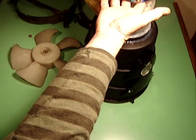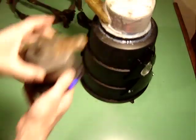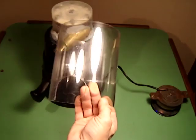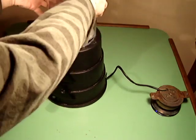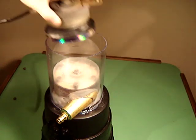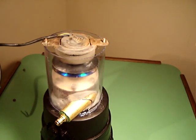Now I have to mount that on top of the CD turbine somehow to keep the magnets separated and make it all work. I've got a piece of six-inch polycarbonate tubing about seven and a quarter inches long that I've got to slot in here — it'll fit over the nozzle for the CD turbine. Now we have a support base for the generator.